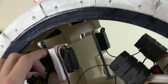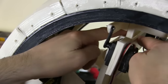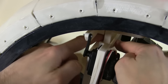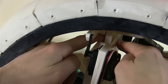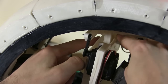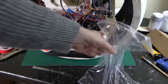Today we're going to try and sort out some niggling issues and also get an actuator so we can actually move that head backwards and forwards. My head is driven by these two servos pushing a rod, which pushes this piece pivoted down here side to side, making the head carriage move side to side. One issue when driving — even with the axis on its end stop — is there's a slight gap, so this piece can move quite a bit, causing the head to wobble as it goes along. I just need to print a little piece to go in here to minimise that gap.